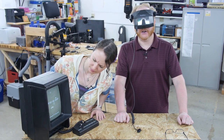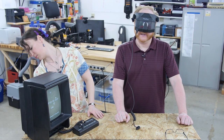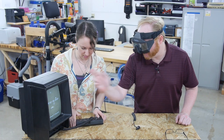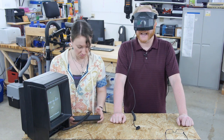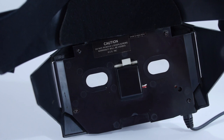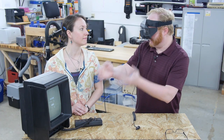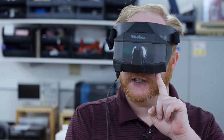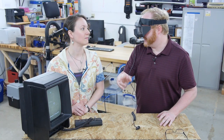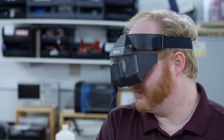Hello and welcome back to the Ben Heck Show. Ben, why is your TV on its side and also why is it so big and what is on your face? Well Karen, let me answer those questions one by one. That is the Vectrex — a vector-based video game system from 1982. Vector means instead of rastering out pixels, it uses the electron beam to draw lines, much like arcade games such as Asteroids and Tempest. Regarding my face, this is the Vectrex 3D imager — one of the rarest video game items in existence. A friend sent this in because he needs some work done. The Vectrex needs new capacitors because a lot of these old systems, the capacitors go bad and the screens start to distort. This device can colorize and 3D-ify the images using a spinning disk. One spinning disk is already installed, but my friend doesn't have the other one, so he's tasked me with reproducing that disk using 3D printers and lasers.